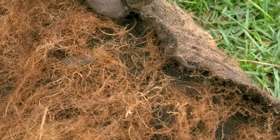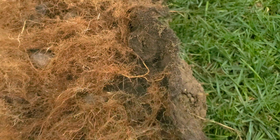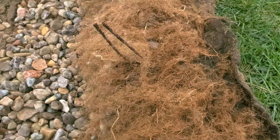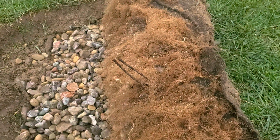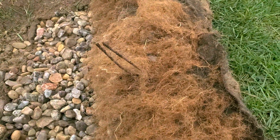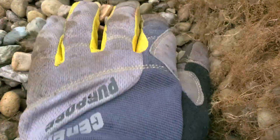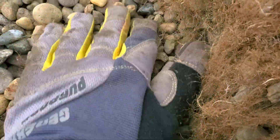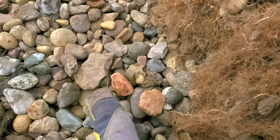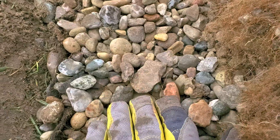This is four-ounce fabric — really good shape after ten years. I really had to saw through it with a sharp blade knife to peel this back and unearth this ten-year-old fabric. You can see how clean it kept the French drain — the voids that move water are open, no dirt migrated into this French drain system.